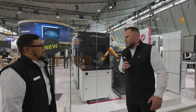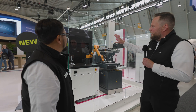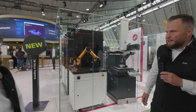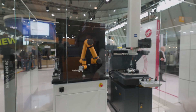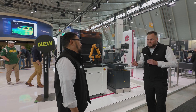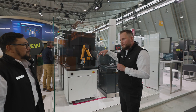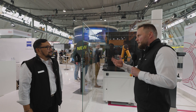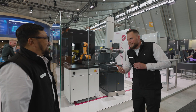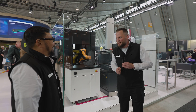So we actually have a bunch of innovations here, a bunch of highlights. We have one new ScanBox for RC here. The RC type of ScanBox is specifically designed to be integrated into an automated environment. What you see is it comes with an automated side door for the purpose of loading and unloading parts. It's equipped with an automation interface for data exchange, remote control, starting CNC runs, getting feedback of results, and of course it has the powerful HSQ optical sensor inside.